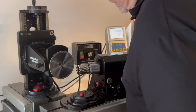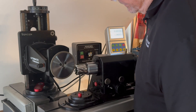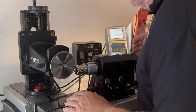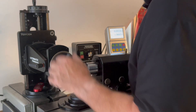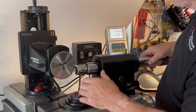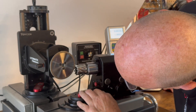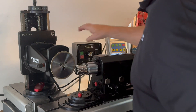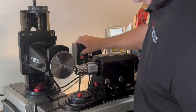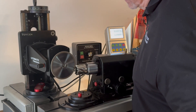So now we've come up. We've rotated the air spindle to about 10 degrees. We've come up about an inch off center. So now we've got a little clearance angle as a byproduct of the wheel shape, and we're just going to go around and touch these up.